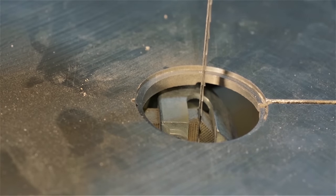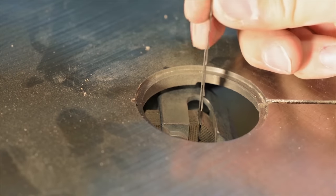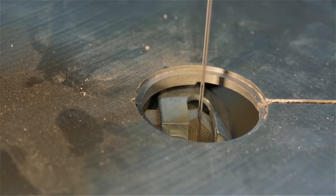On the lower blocks, I tend to put them a little tighter than the top ones. It doesn't matter, they're cool blocks and they'll wear nicely. Don't waste your time with that dollar bill or piece of paper stuff. You want maximum support. Even when running this tight, I've never had a blade heat up. These carbon blocks are amazing.